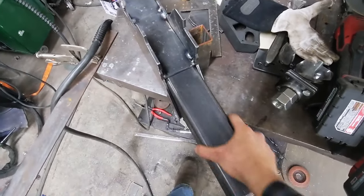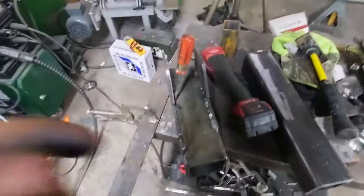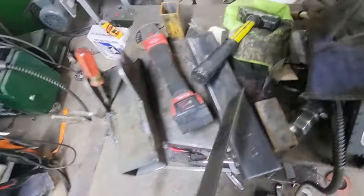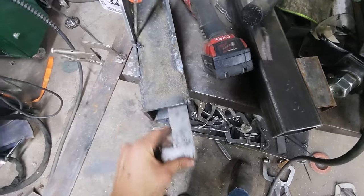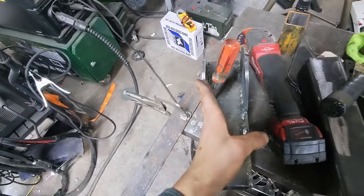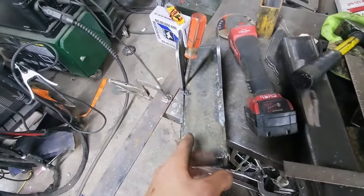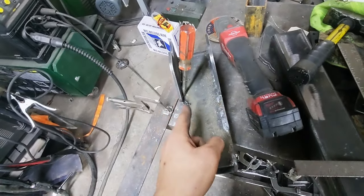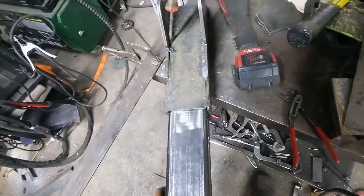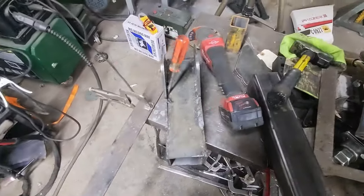It's still hot so it could shrink a little bit yet, but that's a lot better than before. This side is nice and straight — if I hold a straight edge on the inside it doesn't rock at all — but this side rocked a significant amount. The middle had bowed in just on the top; the bottom seemed fine, and the tube wouldn't slide in anymore. So I cut my weld along the top, hammered a screwdriver in, and tacked it again. Now let's check if that fixed it. It slides in for now — I'll weld it up and see if it still does.